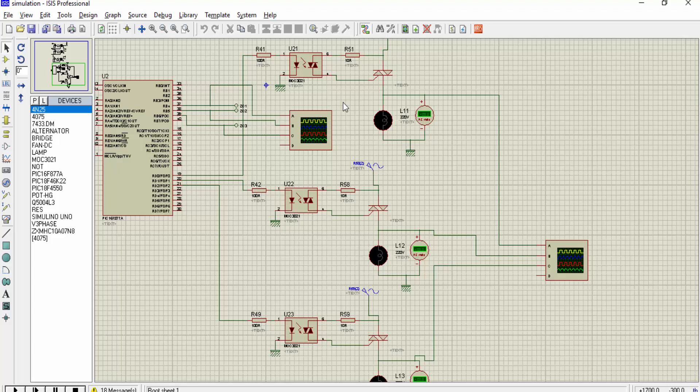At start, we will provide a low voltage to the three-phase induction motor and we will increase this voltage gradually. With the gradual increase in voltage, the speed and current of the induction motor will also increase gradually. This way we can avoid inrush current and keep the motor starting in a soft start mode.